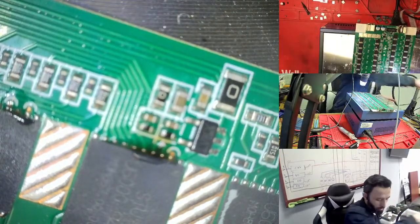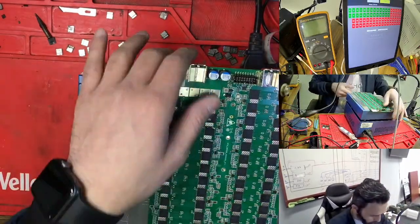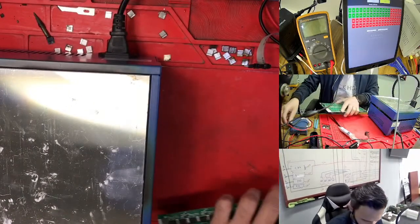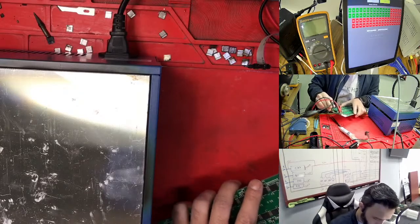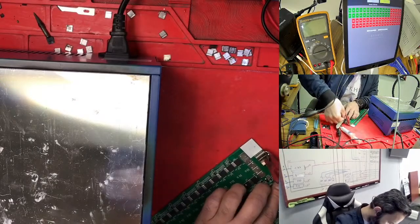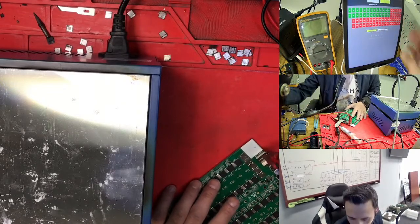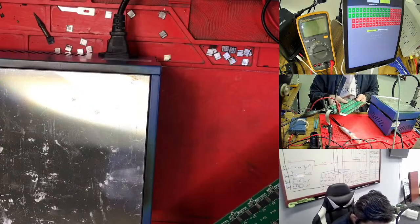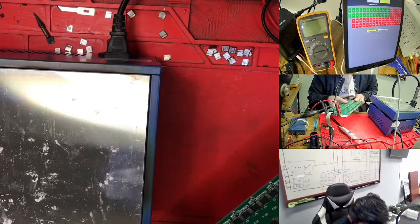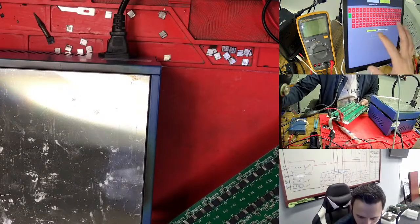So suppose right now you need to block 26, so you need to pass, but we need to try again. So right now it is good, so we clock the hashboard again to see what is going on. Exactly, it is blocking at N26, but what I see is the chip is coming too hot. 26 is coming very hot. So I'm stopping my test here.